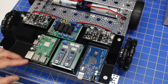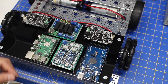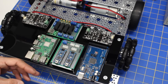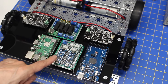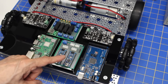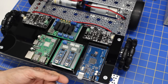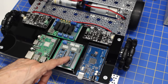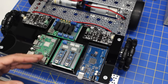The Raspberry Pi has a number of connectors on this side. I've mounted everything so it faces out this way. It's going to have an Ethernet cable which will go up to the layers above. It also has Bluetooth and Wi-Fi. The USB may or may not come into play. I'm going to be using Nanos on here as opposed to Pro Minis or just an ATmega328 chip, and the reason is the USB ports. This is a development robot, so I want to be able to quickly change software. The mini USB will be very useful, and I could also connect those USBs over to the Raspberry Pi and use it as an interface.